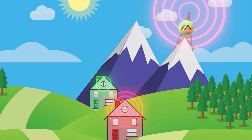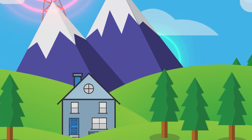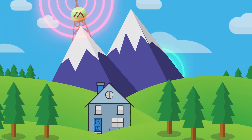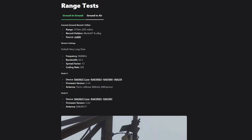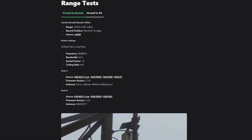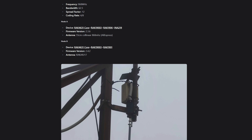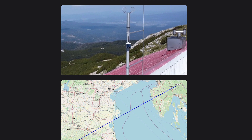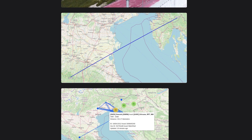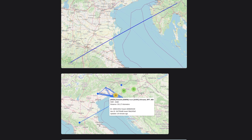But if there is a large hill in the way between two devices, that might stop the signal altogether, like in our mountain and valley example. That's just a thing with using LoRa, and it's a big reason why this meshing interconnected nature can really help with coverage. And if you want to take it to an extreme level, with line of sight and some serious hardware, people have gotten dozens to even hundreds of kilometers with this. But that's using more advanced hardware than you likely have with your off-the-shelf setup.